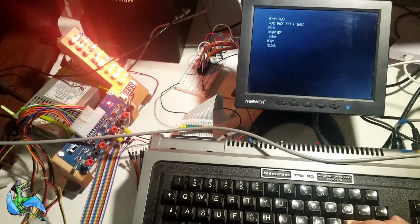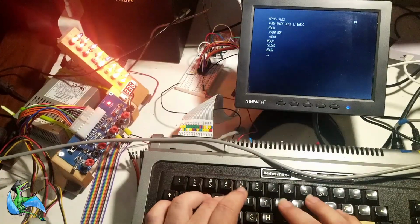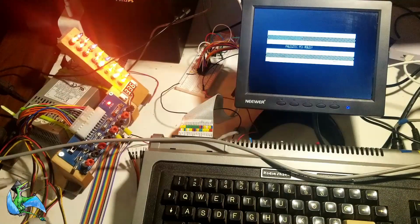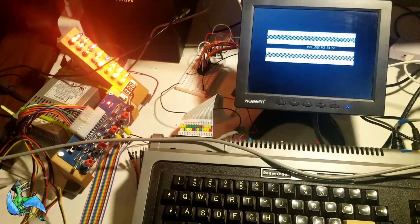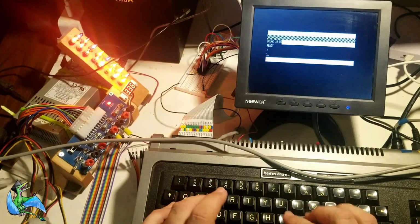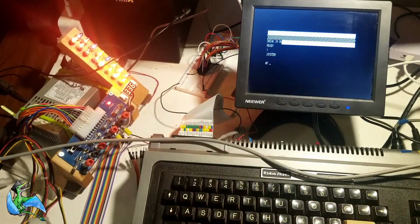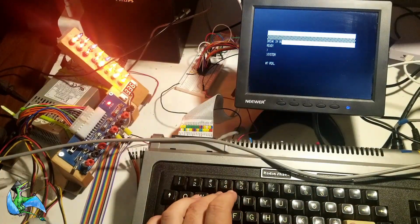So now we're just loading a couple things to make sure the new memory works. The first thing I'm going to try is the little BASIC intro graphics thing that you saw at the beginning, where I have my Paleozoic PCs bouncing back and forth. This is a pretty short BASIC program, so it doesn't prove a lot, but it does use a string packing technique to do the bouncing, which means that it does exercise the top of memory a little bit, because that's where BASIC stores strings.